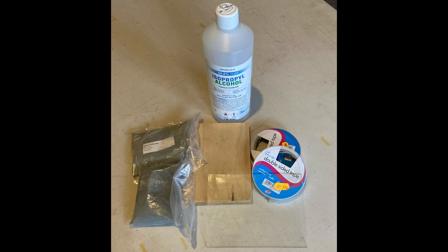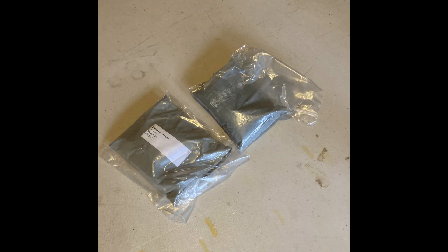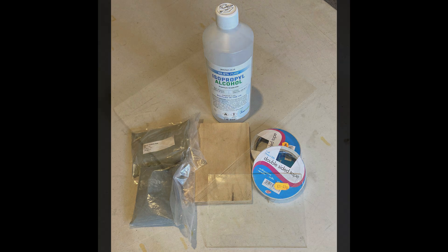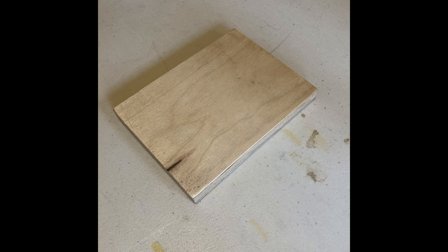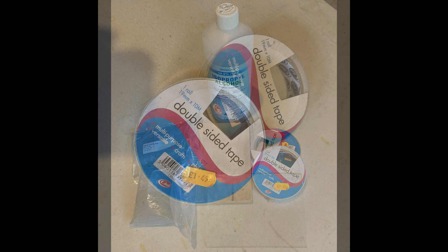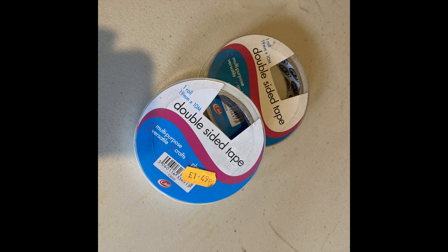In this picture you can see most of the stuff I used to do the screen grind. On the left you can see silicon carbide powder — I got that from eBay from a place that does stone tumbling kits, and I'll put a link in the description. I got some 400 grit and some 600 grit: 400 for the rough grind and 600 to smooth it off. In the middle you can see a wooden block which is about the size of the screen. There's also some double-sided adhesive tape, a piece of glass from an old photographic plate, and some isopropyl alcohol to clean the glass so that the double-sided tape sticks properly.